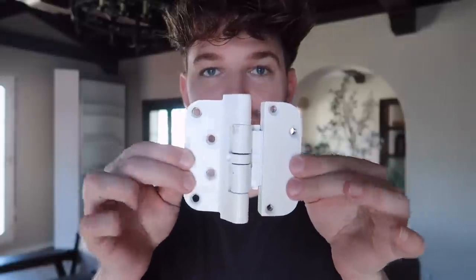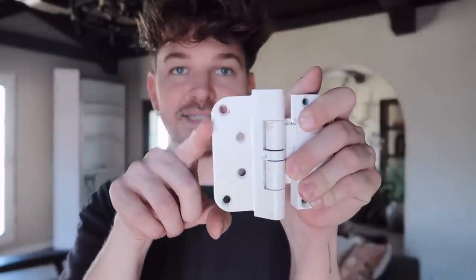So that's what's happening today - we are going to be attempting to install the stained glass doors. I picked up a couple of new hinges at Lowe's, just your generic door hinges that fit in the grooves of the previous. The previous hinge is so thick - I think it's just because these doors are metal-framed and triple-paned glass, so it's pretty heavy. I wanted to find a hinge that was this exact same shape on both sides so that we could install the doors as you would traditional doors.